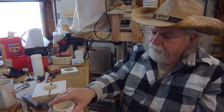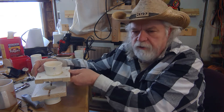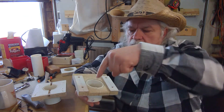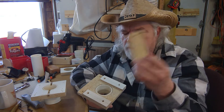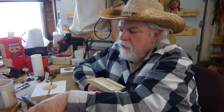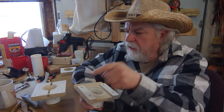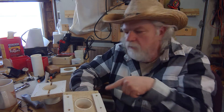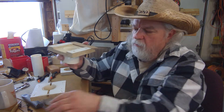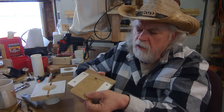The lower piece is a little different. It has four holes to hold the two pieces together — that's how I use four screws so I can take it apart if needed. On the bottom side, I cut a quarter inch deep dado — which is the thickness of my gate — down through the center over where the hole is, so the gate slides in and is guided by the slot. On the back side, where the relief gate and clean-out is, I go across there and that's where this piece sets down, with the pin holes lining up to align it. So when the gate closes, everything is sealed and you don't get any vacuum leak. That's basically how it works — the slot is still half an inch thick, which is plenty strong, and I have the slot for the relief areas.